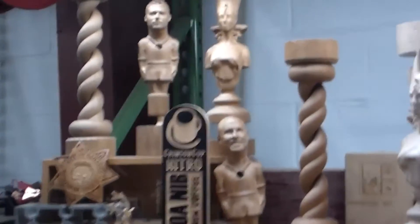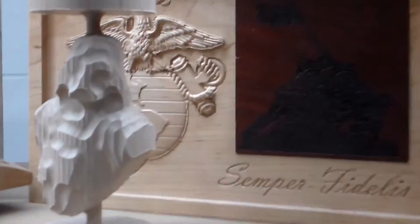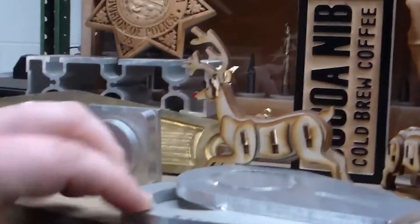We've got people doing Darth Vader heads and hammer handles — artistic pieces that are scaled and detailed so they don't have to do the hand carving. This machine is really built for artists. The primary focus would be small signage companies, home hobbyists, small shop work, and artistic pieces. But we also have guys doing simple two-dimensional aluminum brackets and fabricated parts — more affordable than your standard mill, though cutting metal requires a slightly different approach to machine maintenance and setup.